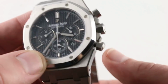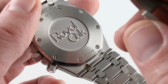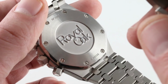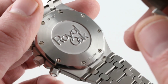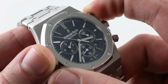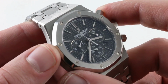Now, what's inside? Well, it is a Frédéric Piguet 1185 prepared by Audemars Piguet. So here's the thing. In the Vallée de Joux, this is about as good as it gets chronograph-wise. Very thin, fine, automatic winding with a 40-hour power reserve, nicely finished to a degree befitting Audemars Piguet's marque. It features both a column wheel and a vertical clutch. The column wheel for crisp actuation. You can feel it, you can hear it, and that's the alternative to a cheaper cam or shuttle-based system.